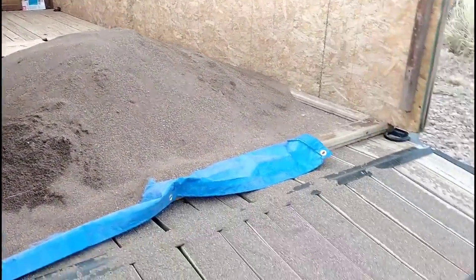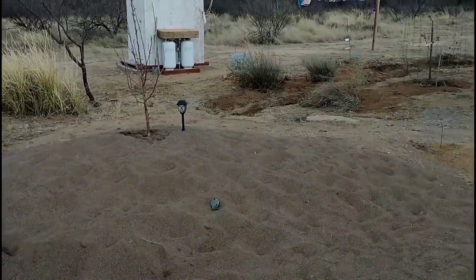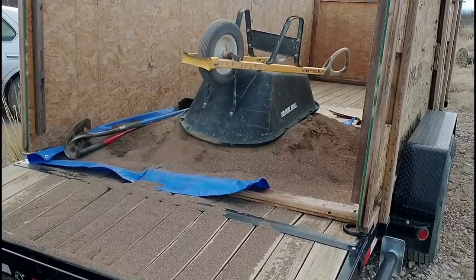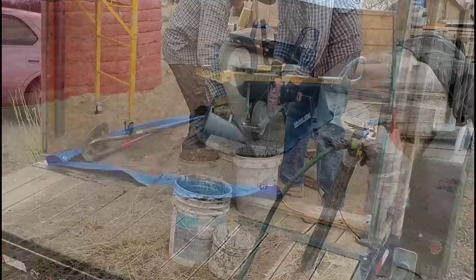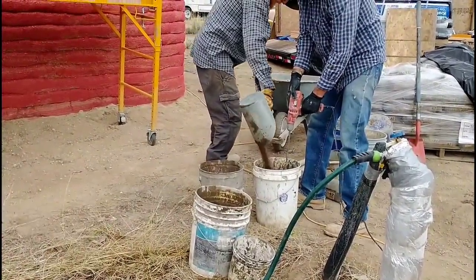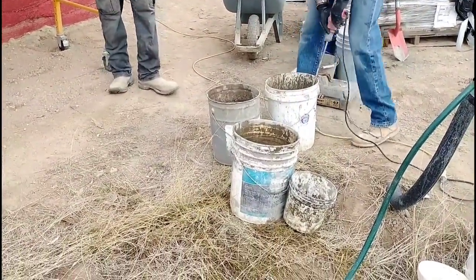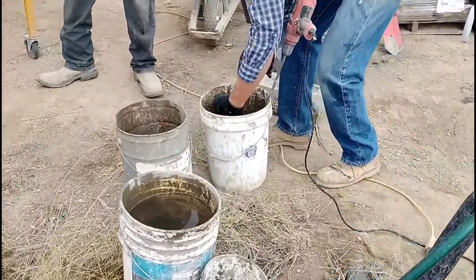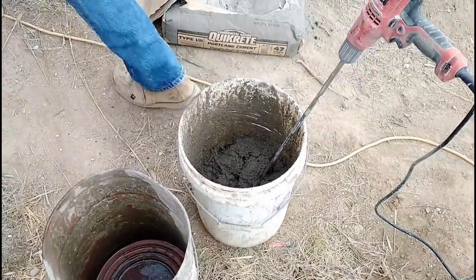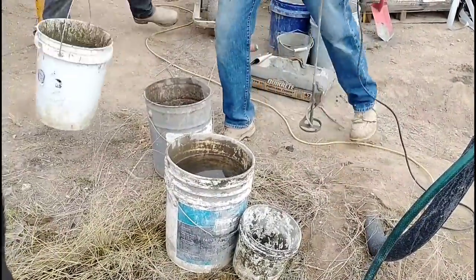The rest of the family was here visiting, so we decided to get together and have a family work party. The first thing we needed to do was load up some mortar sand left over from our build into the trailer to take it up to our son's place. It's the day of the work party, and we're getting started on the stucco. My son and I are working on mixing the first batch. We decided to make our own stucco using a basic recipe of one-part Portland cement to three-parts mortar sand, making small batches in a bucket using a hand drill with a mortar mixing attachment.